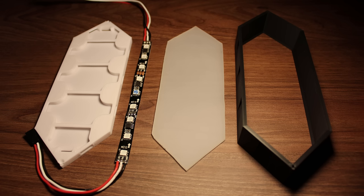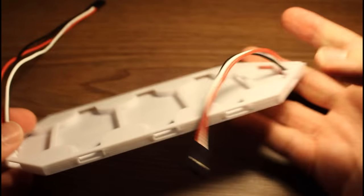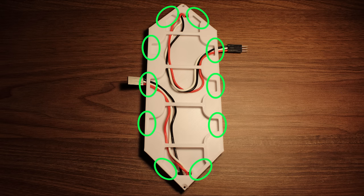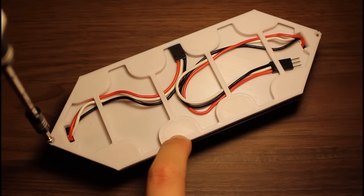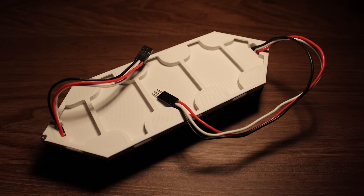Now let's talk about the lid, which is another 3D printed part. On one side, this is where the LED strip will be attached, with the wires feeding through holes to the other side. On the other side, we can see how the wires can be routed depending on how we connect the segments together. There are wire channels to allow wires to cross to other segments without showing from the front, and beams that hold the wires in place so they're not sticking out when mounted to the wall. The lid attaches to the main housing using M2 bolts — 8 to 12 millimeters long — on either side.